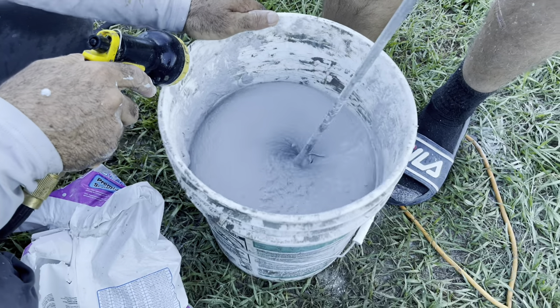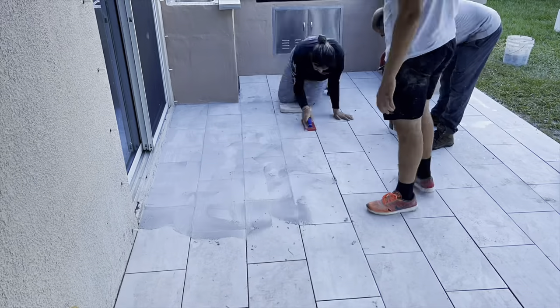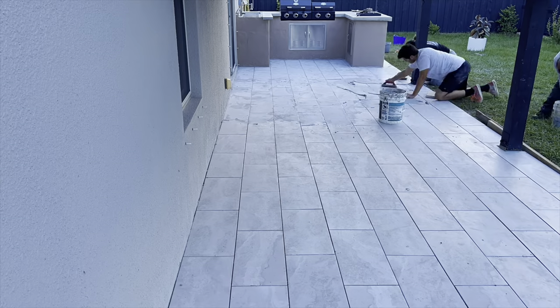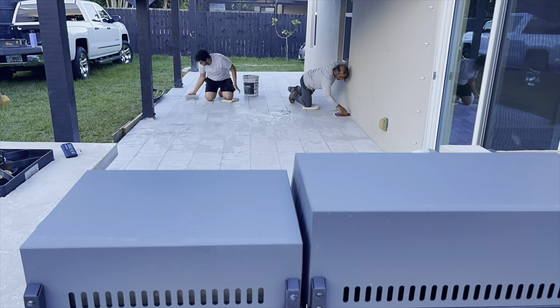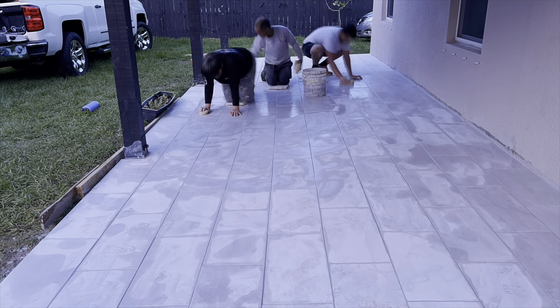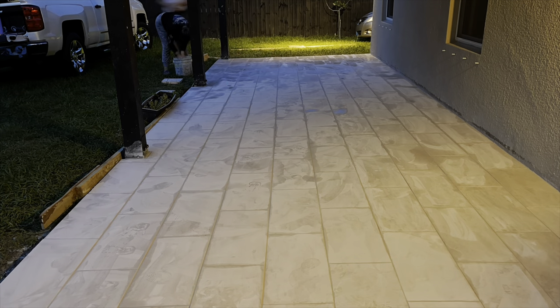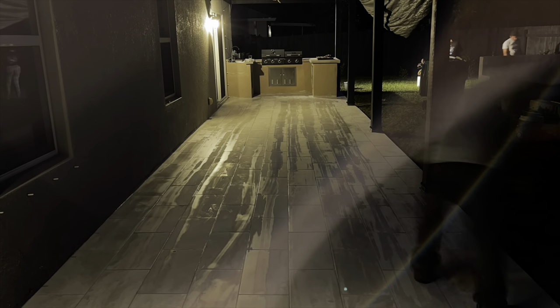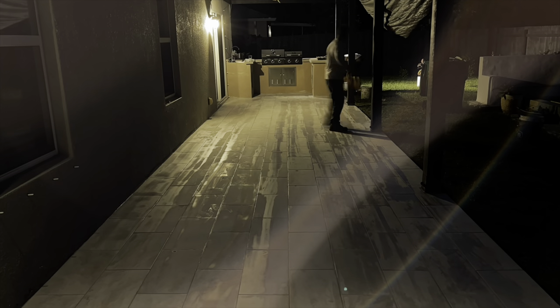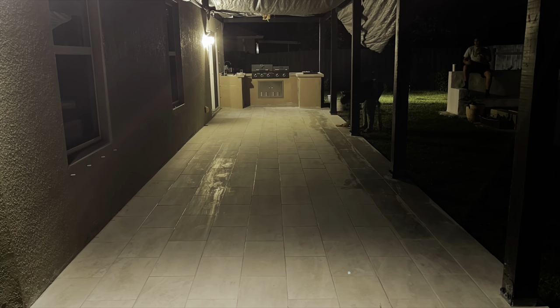We are reconsidering painting the whole kitchen — the kitchen looks salmon-y now with the tile. Now it's time to put the grout. To prepare the grout mix, we followed the instructions on the back of the bags. To apply the grout, place the mix on the tile and spread evenly across the floor, making sure to get into all the crevices between each tile. We prefer to leave the grout on the wetter side since it's easier to spread — a drier consistency will bunch up on the tile. Cleaning is a key step: as soon as you're done spreading, use a wet sponge and bucket to remove all excess grout. We cleaned the floor a total of three times. Make sure to remove excess grout while you can, as the more it cures the harder it will be to remove.